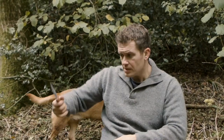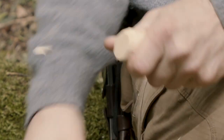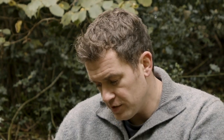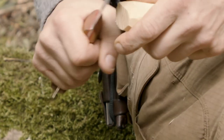I'm going to take my knife in a full grip — I'm right-handed — working over my right-hand side, supporting this in my left hand. From about an inch down, I'm just going to push and turn, push and turn, push and turn, and just be patient. If you've got a good sharp knife, the knife's going to do the work for you. I'm not pushing especially hard, not having to push through any knots. Just take your time, keep going round — it's about uniformity.